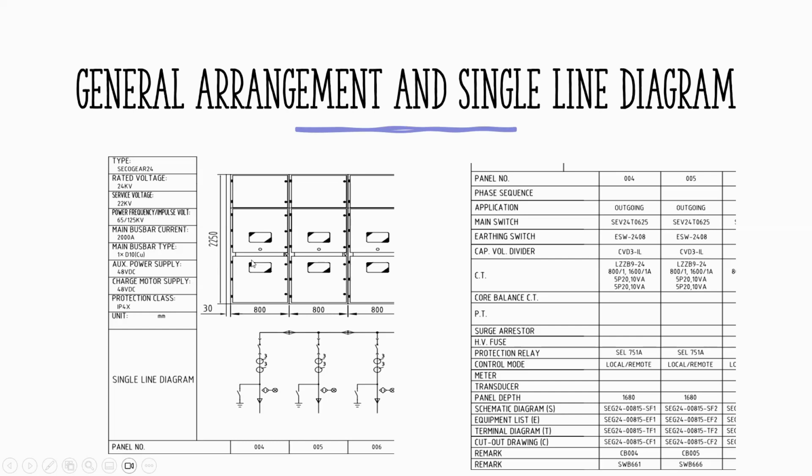So that is the specific specs of this. When we go to the factory, in my previous job, we check all of this, you know, gasket, make sure that it meets the IP4X. That is about the external construction of the board. It means that no foreign object that you can poke inside, it should be contained properly.